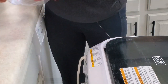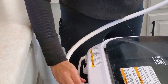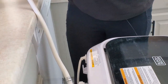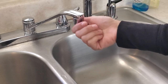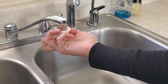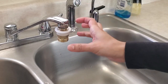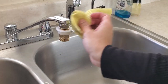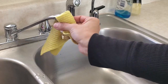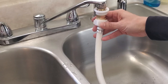We're going to put in the water supply hose. This other end will attach to our sink, which we'll do here in just a minute. I already have a tiny bit of Teflon tape in there, and there are two washers already on here. Hopefully that'll do the trick - if not, I'll add more Teflon tape so this doesn't spray around. We'll fix that as we go if we need to make any adjustments.